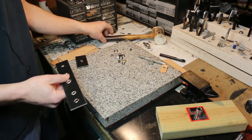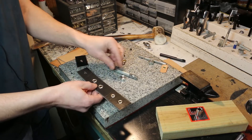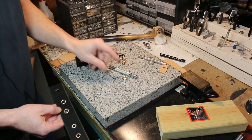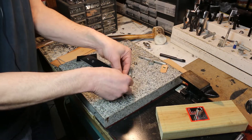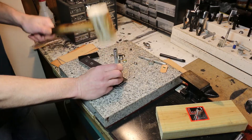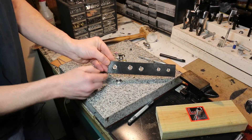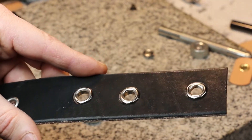Let me show you what happens if you don't have the right size tool. This looks like it should work for these, and it kind of almost does, but it doesn't quite snap into place — it's not sitting on there perfectly, it kind of wiggles around. Now look what happens when you set that with the wrong anvil — and this is probably the wrong tool too. I used the same exact amount of force, but it certainly doesn't look as nice. Look at the front — it's very, very misshaped. So it's bent, doesn't work right. You have to use the right tool.